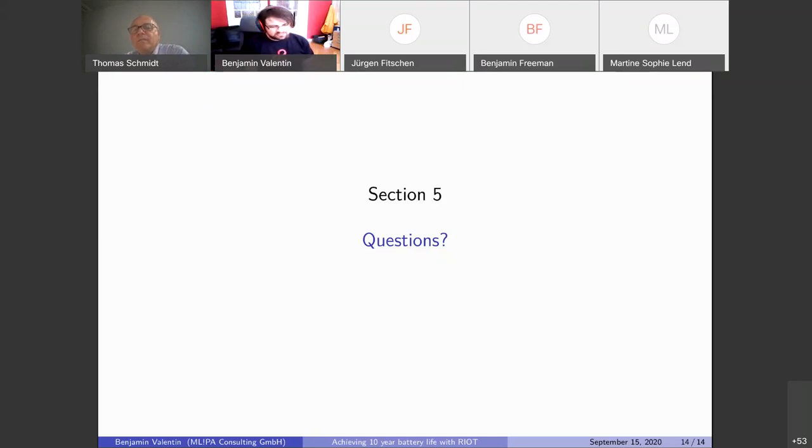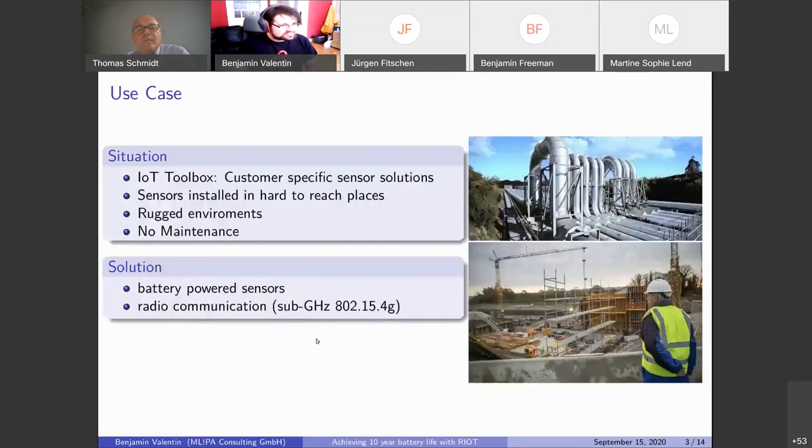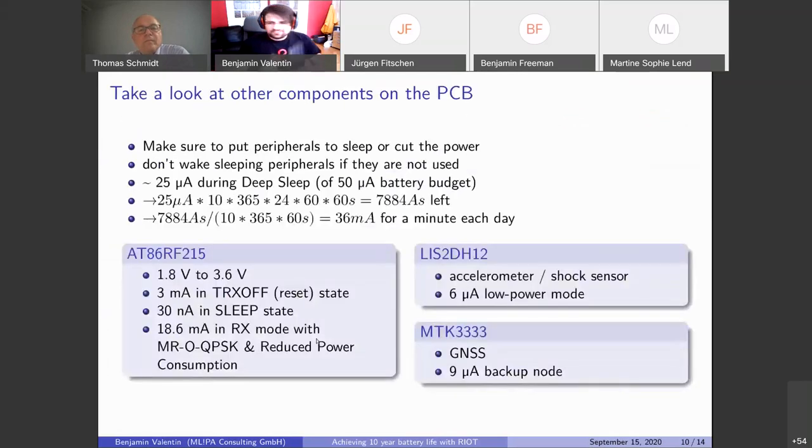Yes. This is the new Atmel radio. It's basically on the board. Actually, it's even two interfaces, the sub-GHz one and the 2.4 GHz one. It's one of these new 802.15.4g devices. They have this 2 kilobyte MTU, so we can also send large frames without fragmentation, and have lots of modulations that can be used for quite robust and long range communication. Right, we got some 600 to 800 meters with it on the sub-GHz band. With this board, we have just some chip antennas on there.